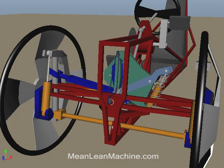This concept shows leading arm front suspension on the front wheels that will most likely not be included due to weight considerations and will have to wait until the motorcycle-powered version. It also shows a dampened spring assist for the transition to normal steer. On a motorcycle, this would be hydraulic and would power the transition between normal steer and free to caster.